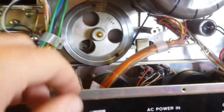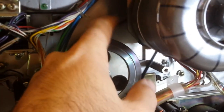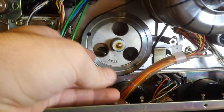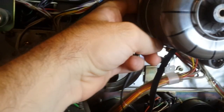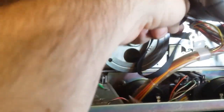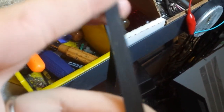With the backing plate off, you now have your capstan exposed. The belt on this is a little tired — it's very much lost its elasticity. Taking the belt off is pretty easy; just slide it off the capstan flywheel like this, then slip your fingers up and over the motor pulley to get the remainder of the belt off. Some of these have dual frequency pulleys — 50 and 60 cycle — which can make things difficult because you have less space to deal with. This belt is so stretched out it's unbelievable — we're going to have to put a new belt on anyway.